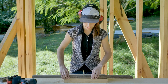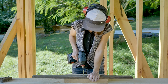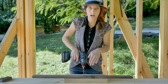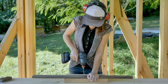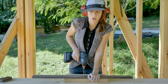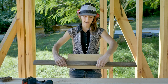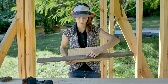We want heavy downward pressure with our supporting hand. As you'll notice, I'm coming up on my toes a little bit because I want an even more direct line from my body through my impact driver into the screw going through the boards. I'm still going to be rather light on the trigger because that gives me more control. Now I have two boards that are well attached, and my screw is just below flush with the surface — which is where you want them to end up.